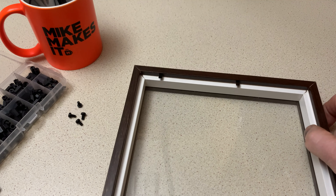So what we end up with is an electronic sandwich. You're going to have the card — see if that's sitting in there — you'll have the display, and then in a few moments I'm going to go to the garage where I'm going to mount the Raspberry Pi Zero W. Four holes on it, and here you're going to have a slot for the ribbon cable to stick out of, so you're going to end up with a bit of a sandwich like so. If we turn it over gently, you can see the depth — we've got about three quarters of an inch from the glass to the back of the display, and that'll look really nice, that'll pop quite well. You could use a flat frame, but I think this will give more effect.